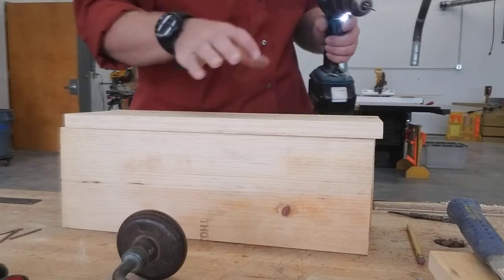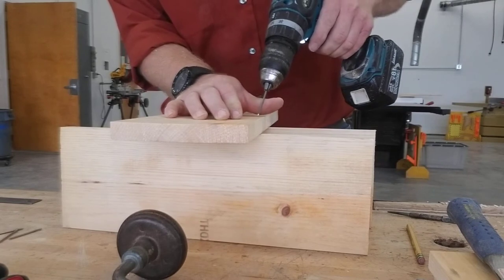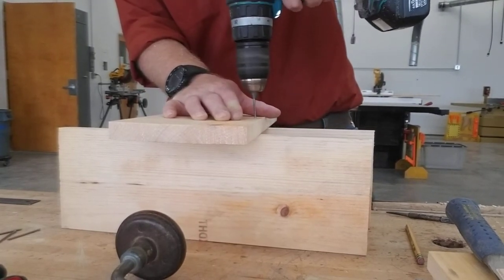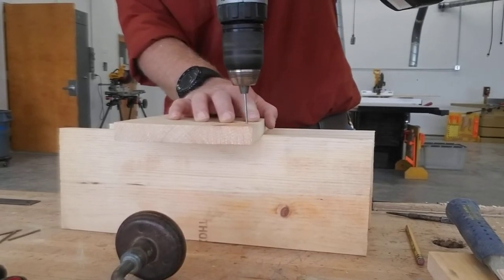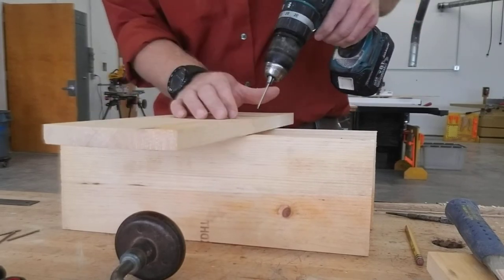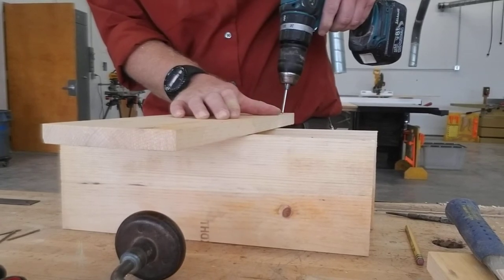It's like a drill bit set this way, so I'm not going to puncture my wood. I'm going to come in three-eighths of an inch from the bottom and use this as a drill bit. All we're doing is compressing all the grain out of the way, and it will stop the wood from splitting, which is pretty soft because we're using pine.